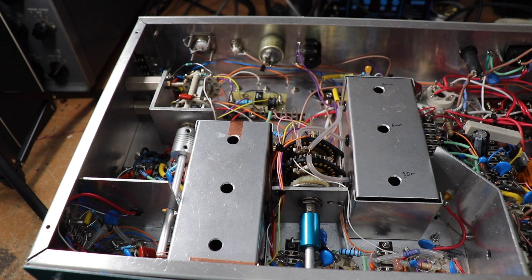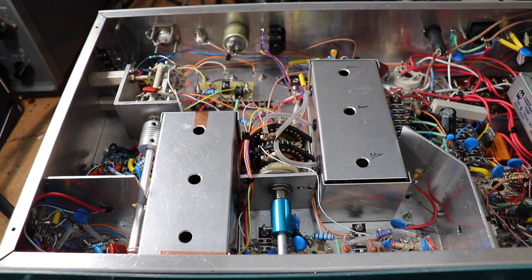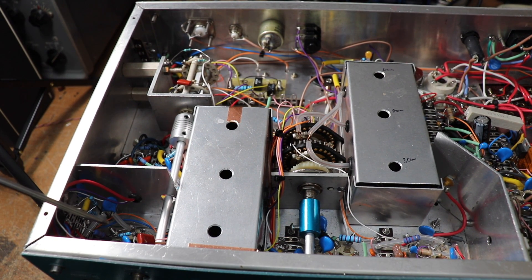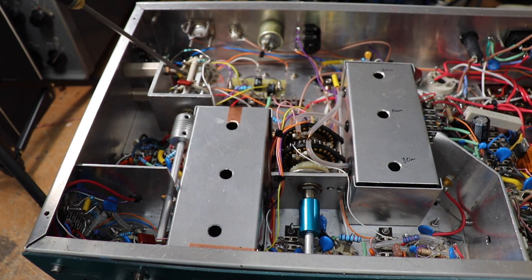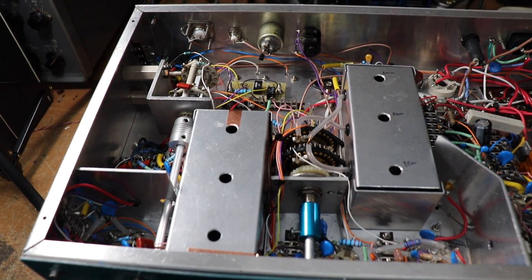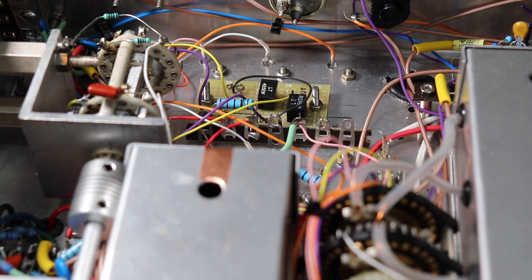So this is the underneath of the receiver. What I've tried to do is compartmentalize it, which I think you have to do for receivers — especially Superhets where you've got local oscillators, preamps, IF amplifier stages and all that. So here you've got the little compartment for the preselector, and then most of this area is for the IF stage. That's the filter select switch, using a combination of crystal filters and also two little ceramic filters for the 6 kHz and 15 kHz, which don't cost very much — you can buy those off eBay for a couple of quid. Quite good for building receivers.